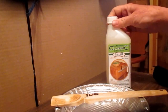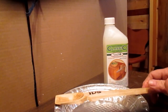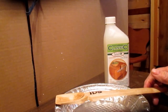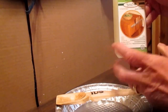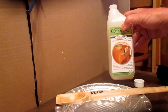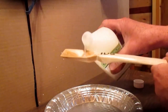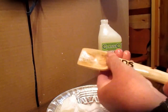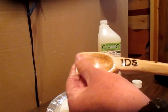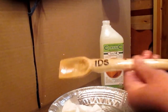For the protection of the wood, you need an oil. I used hemp oil for a long time, but it gave a slight greenish coloration to the wood. Otherwise I used olive oil. I found this oil which is made for a butcher block or cutting board, so it's safe for food preparation. You need to apply it well everywhere. This oil is quite viscous. You can apply it with your fingers. I apply three coats — between the first and second, wait one hour, then a good twelve hours before applying the third.